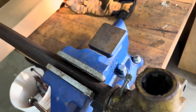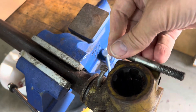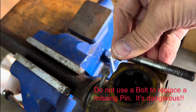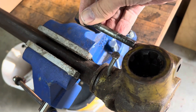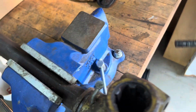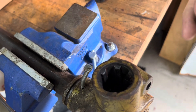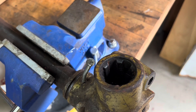Cool, thanks. What happened with the gang mower is, on the PTO shaft, the pin had broken, and the original owners had put a bolt through the hole in order to keep the coupler onto the PTO shaft. However, last time I mowed, I sprayed a little bit of WD-40 on that just to keep it lubricated, and it disengaged from the PTO shaft.